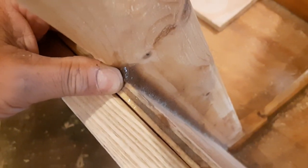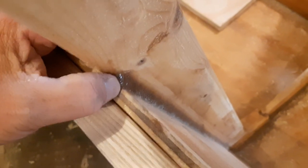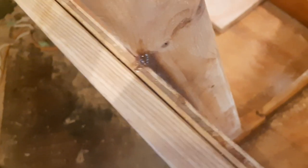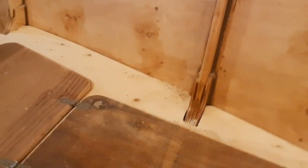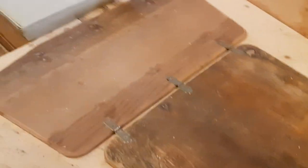It's not so much wood on wood as it is the fillet getting into the gap, and that makes for a very strong joint. I use wood flour, which is actually structural — the micro wood fibers crisscross and link up when it hardens, making it ridiculously strong. I'd highly recommend sticking to wood flour. I filter my own from my sanders.